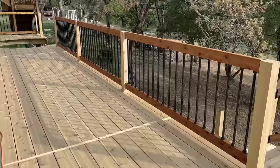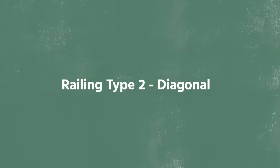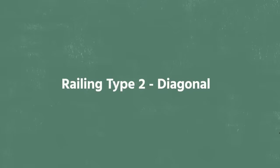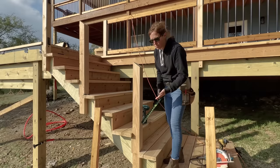That's how to install very straightforward traditional railing. Next let's move on to how to install railing on stairs. The main concept is the exact same, so in this section I'm just going to cover the differences. I already have my post in, but I will show you how to set those in just a minute. The first thing you want to do is get your dimension on setting where the railing needs to go.